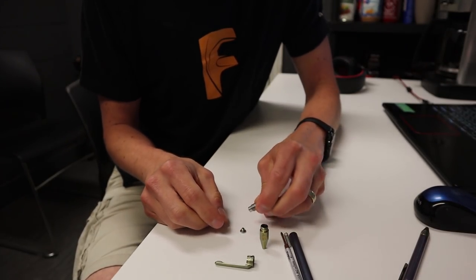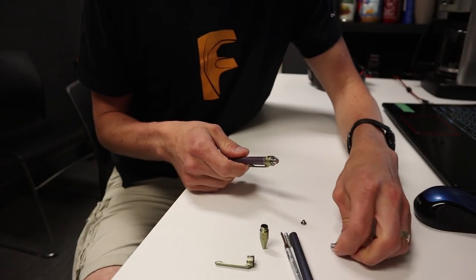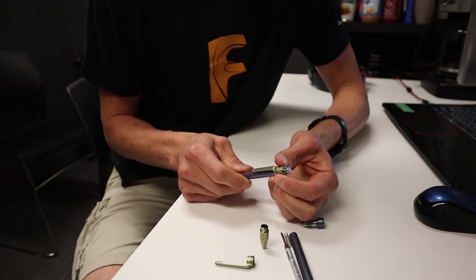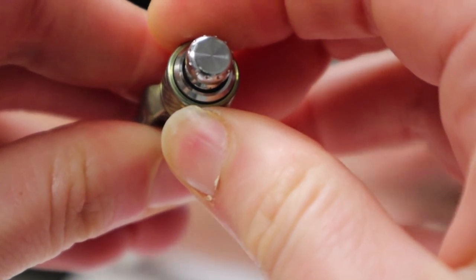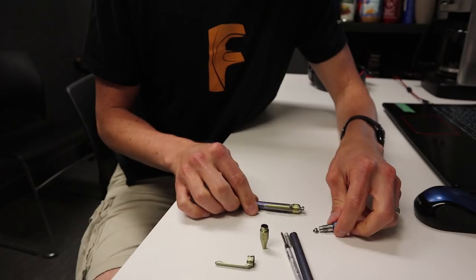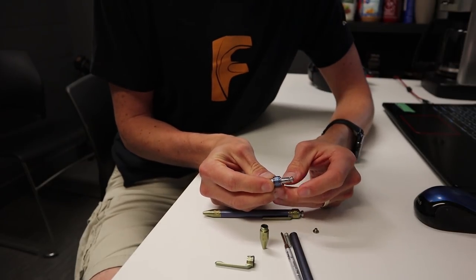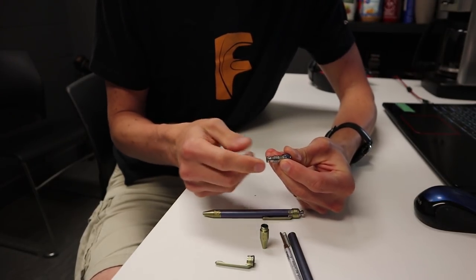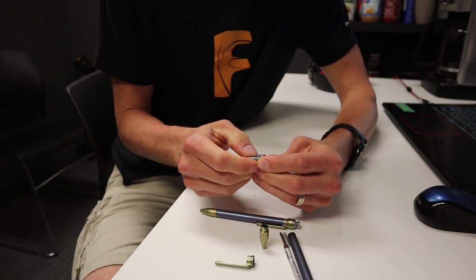That little button is threaded right now, but I think I want to make it a press fit. Right now we Loctite these in, but if there's no Loctite and you rotate the slider, the button actually moves in the opposite direction — which is a neat little feature — but if you do it too much the wrong way it'll unthread the button and the ball bearings will fly out. If this becomes a press fit, then the button and the threaded sleeve become a permanent assembly, which I think I'm fine with.